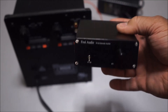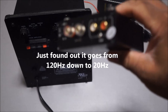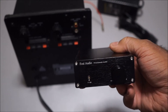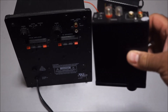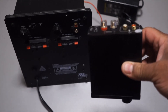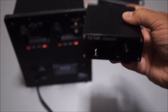What this tri-path amplifier is really good for is custom designs. If you design your own loudspeakers or subwoofers, this would be ideal. When you design your own speakers, you can build a crossover that limits how high the woofer plays. If you want to limit it to 120 Hz, you can build a crossover that does that. Basically, when you add a subwoofer crossover on the driver, you can use any type of amplifier — even full-range — because the crossover will block the highs and mids, passing only the lows. So this amplifier is good for someone who custom-designs or builds their own subwoofers.